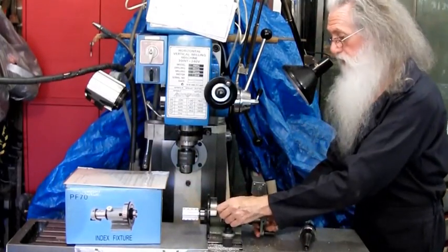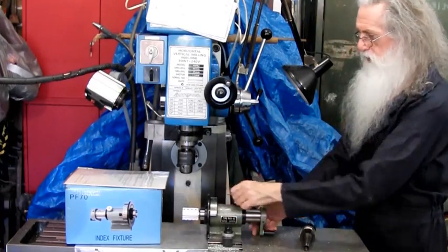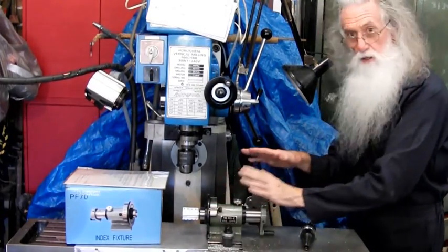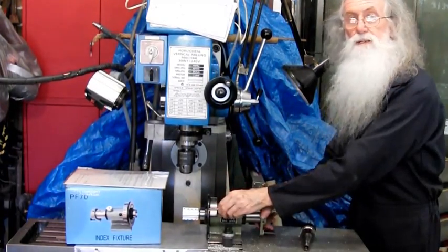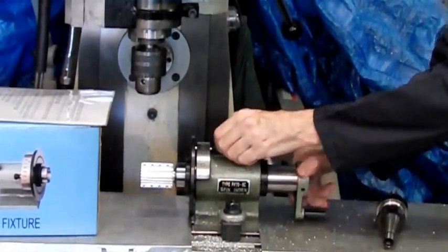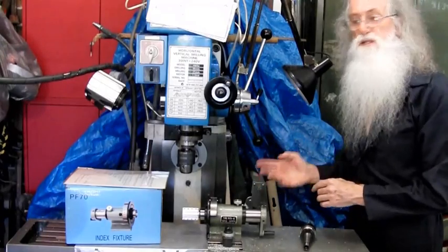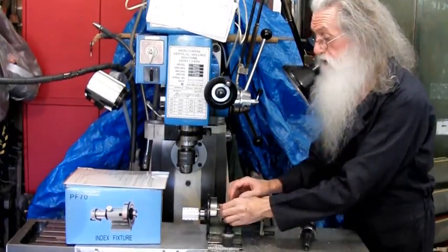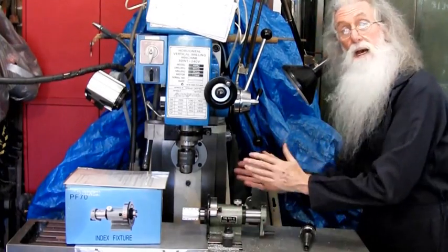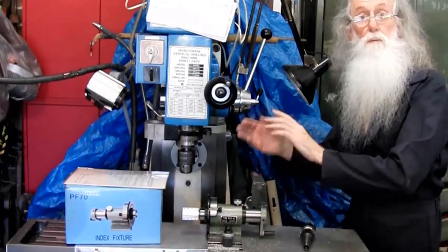So what will happen is you'll go up here, oh yeah, that's 38.4 and that's 30. But then, where is the pin? Always go, just say you're on a full 0, and the next one is 10 and say 5. Nip that down, line it up, then always turn the same direction till it goes in, 5. Now, the next one might be 7. Don't go like that. Put it back into the 0, rotate it, and that will get rid of that extra 0.6 of degree or 0.5 of degree or 0.8 of degree.